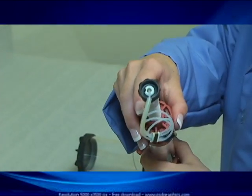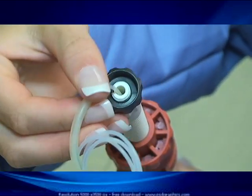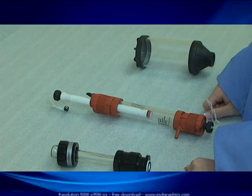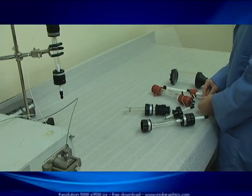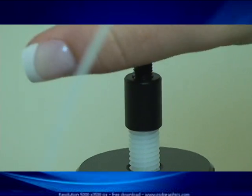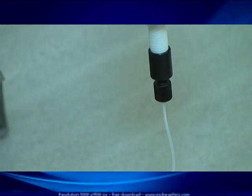Another very important point is that on the comparative column, the inlet and outlet connections are made internally, not allowing the chromatographer visibility of where any leak originates. This could be a problem during a long run — if a leak is not detected, a substantial amount of mobile phase or valuable sample may be wasted. On the ELS columns, the connections are made externally, giving the chromatographer full visibility of any leak. All of our connections are 1/4-28. Since some HPLC systems use M6 fittings, all of our columns come standard with M6 adapters so they can be used with virtually any HPLC system.